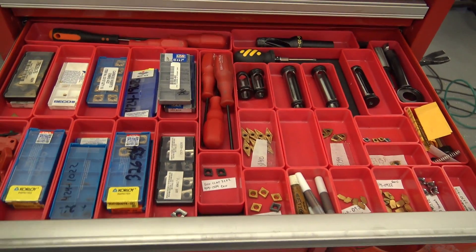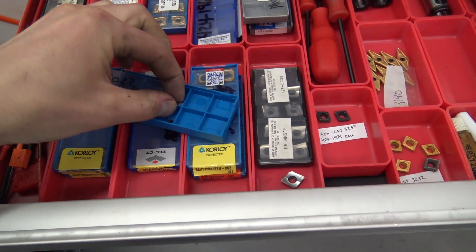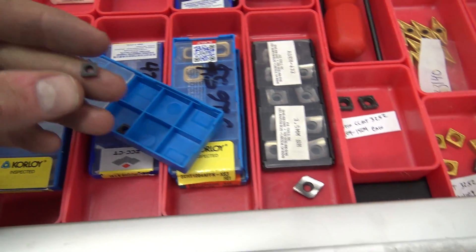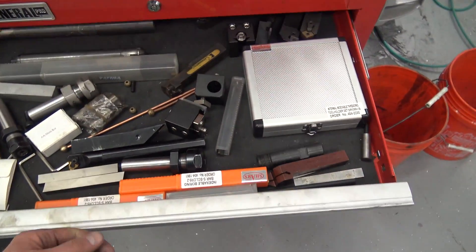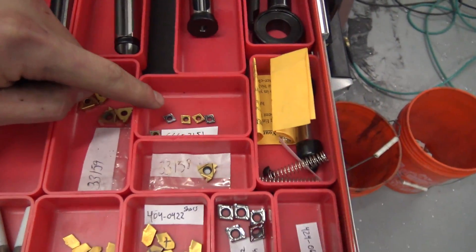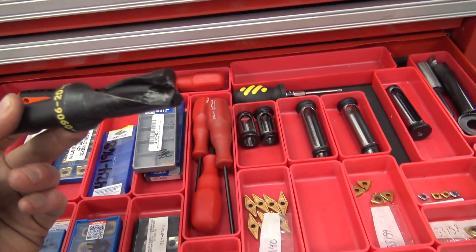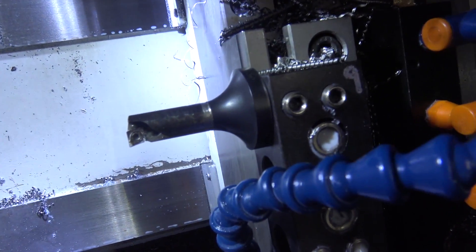We've been getting organized on our inserts with these red bins — link in the video description. We also got the same CCMT type insert but this one designed for steel — all from Shars, really inexpensive stuff. We'll let you know how it runs in steel. That same insert is what we use in some of our smaller boring bars, so it's nice to have one fewer insert type to stock. We've also been loving this other drill that cuts a much bigger hole and has done stupendous work in steel, but I can't find W-type inserts for aluminum — which is actually one reason we picked out this little tool. That's a fun little video. We're excited. Take care folks, see you next Wednesday.